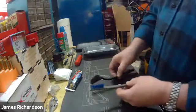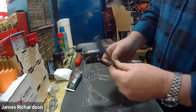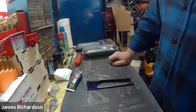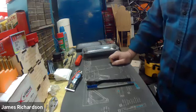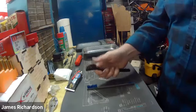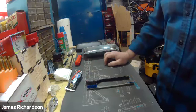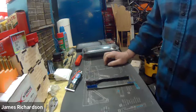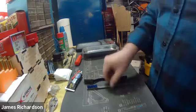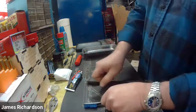I like to use a nylon brush or a brass brush. Don't use a steel brush on a gun — please don't. Steel wool, don't use it. You see people say, oh, it's got a rusty barrel, just take some steel wool and oil to it. Don't do that. Go get some brass wool — nice, fine brass wool — because brass is a sacrificial metal. It's softer than the steel, so it will be damaged long before you'll damage the steel on the gun. If you're taking steel wool to it or a wire wheel, you're pretty much removing steel. These nylon brushes work fantastic. Brass brushes work great to remove heavy caked-on carbon.